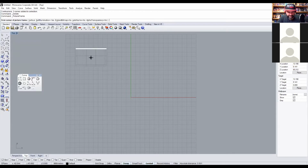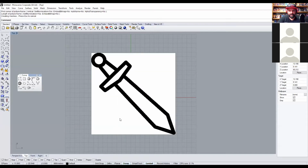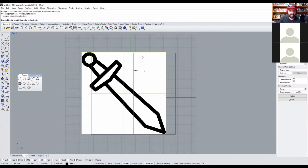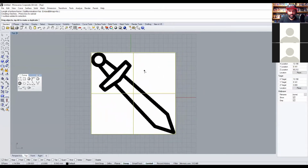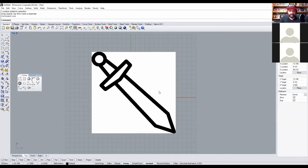Now let me turn off this magnifying glass. Okay, left click, drag. I use the shift button. So I'm left clicking, dragging, and shifting it to lock it in one direction. And left click again, and I'll let go. And now we have a reference photo inside Rhino. And you can move it around. So in order to not move it around, in the command line, type in the word lock, and you're going to lock it in place. And now I can't drag it anymore.